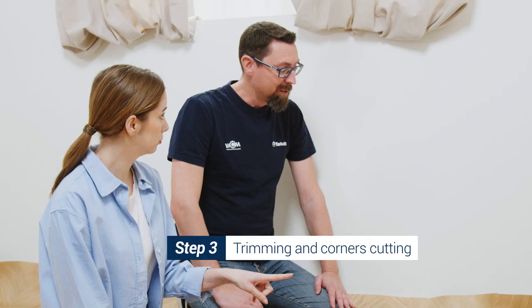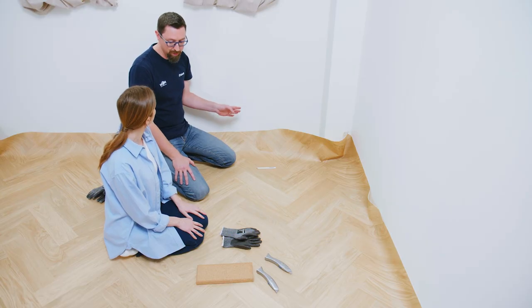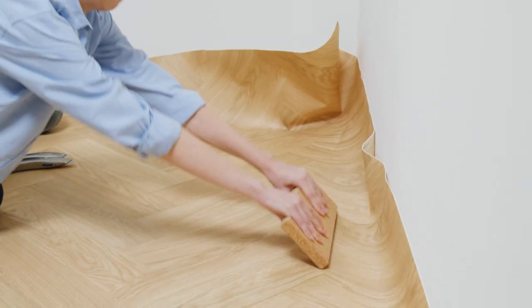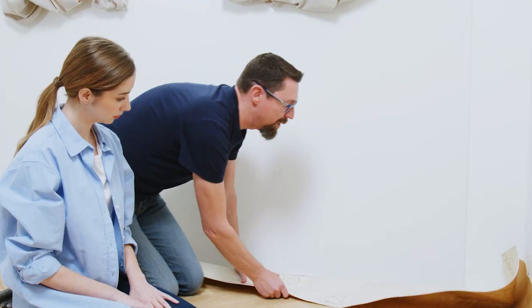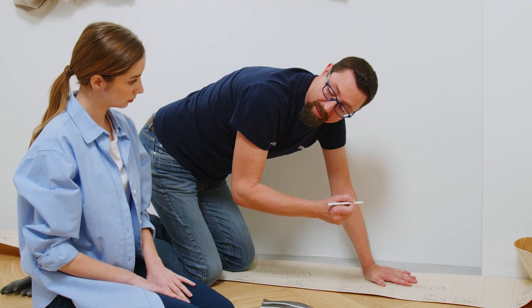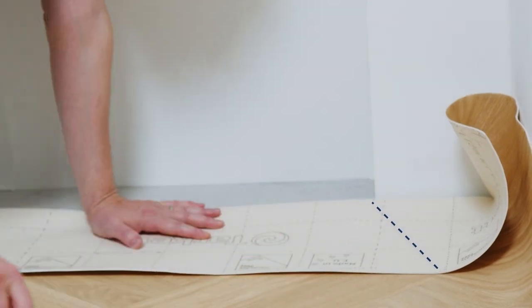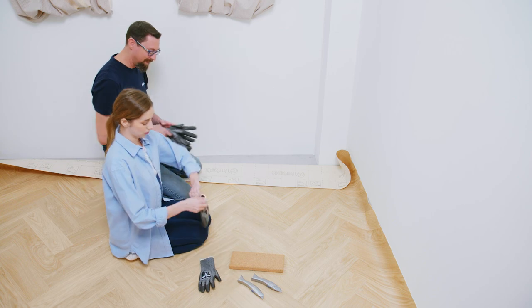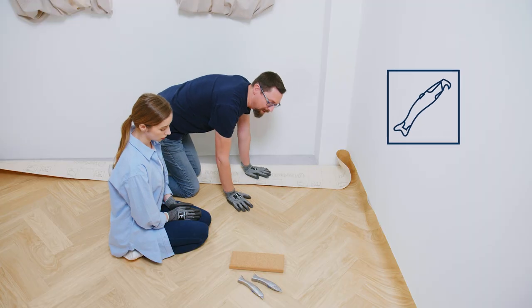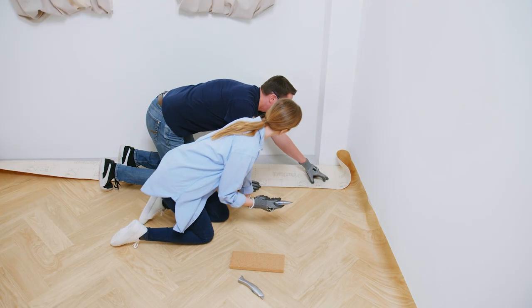So what do I do with the corners now? Quite easy. We will use the cork press to press the material to the wall, and then we will cut in each corner to release the material. So now we will prepare the outside corner. You will bend the material, I will draw a line, and you will just have to cut along it. Sounds good. Before cutting, please use your safety gloves. Just take the hook blade and come closer and cut along this line.